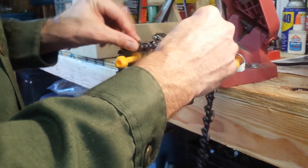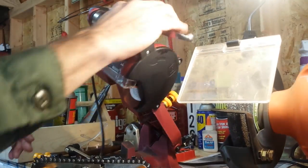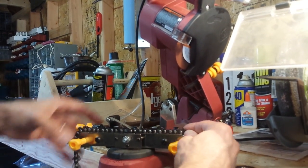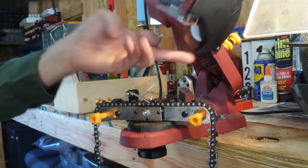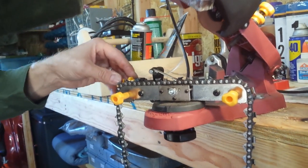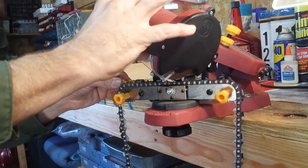To set it up, the first thing you do is set your blade on the rail and make sure your angle is appropriate. This system has a clamp, so you grab the handle for every blade you sharpen and it clamps right here to hold the blade steady. You have to adjust the blade stop back and forth so that the sharpening disc just barely grazes the edge of the blade. Can you hear that crunch? That's the right adjustment. If you're not touching the blade with the disc, you can adjust it in. If you're too much, you need to back off.